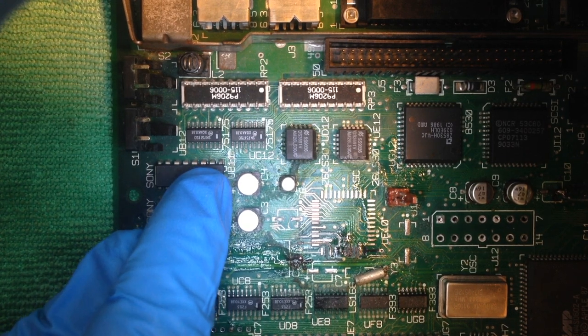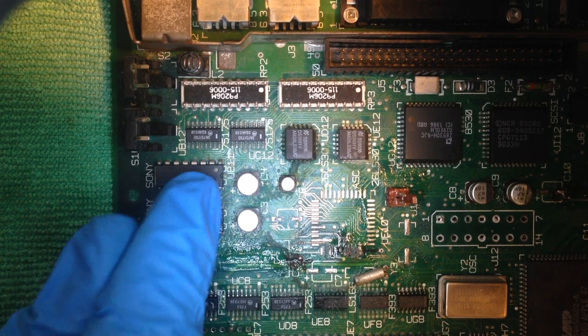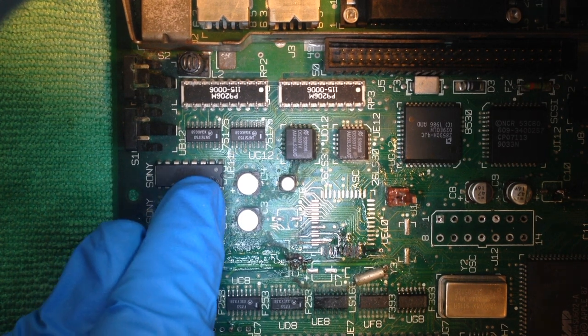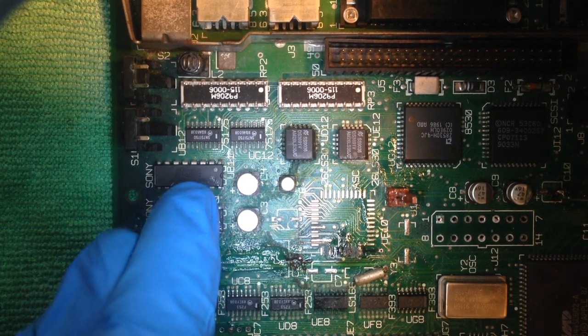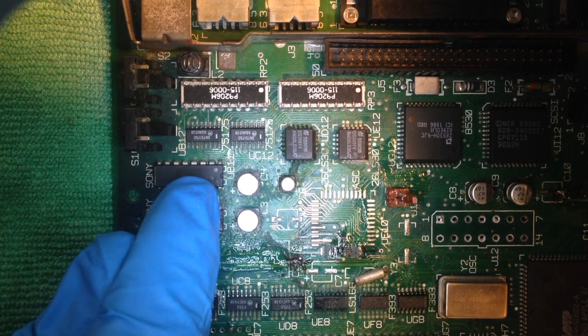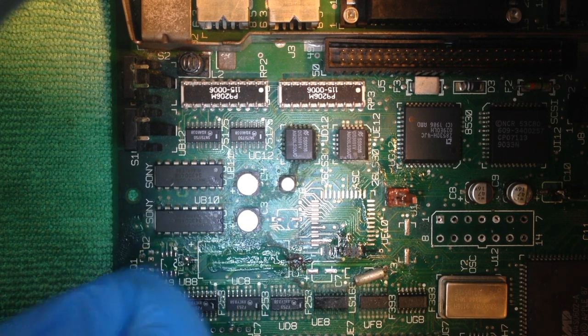Well, I always make sure that the microfarad value stays the same. I like to raise the maximum safe voltage by about 20%. So these capacitors on this particular board would be replaced with 25 volt safe limit capacitors.